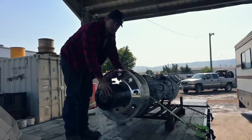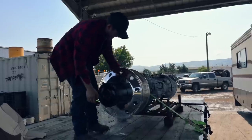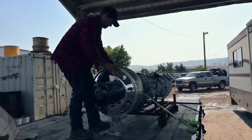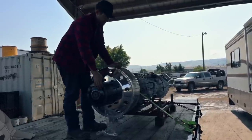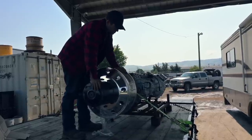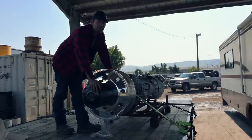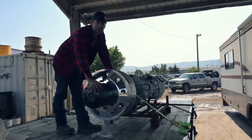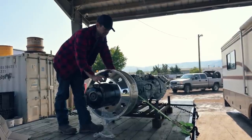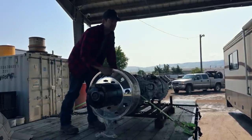Because they've got the planetary hubs on them we need special rims, just because it's a little bit bigger of a hub on here. So we had to order in special rims for it. There's a pallet of rims in there and we have the e-axles and we have never put them on and confirmed with our own eyes that they fit - we've just gone by the measurements. My big concern was: what if this is a different size planetary, what if the electric motor has a slightly different size planetary? Luckily because it's a standard planetary they had a ton of stock in Alberta, which uses a lot of winch tractor planetaries.